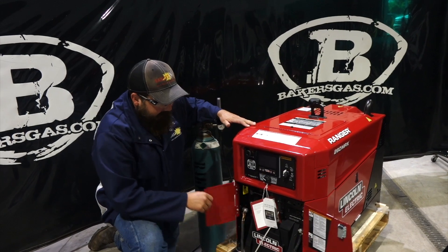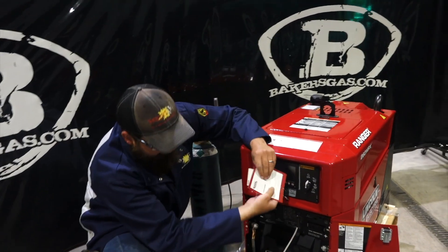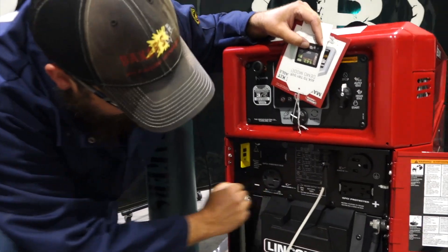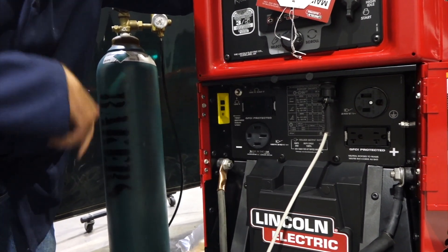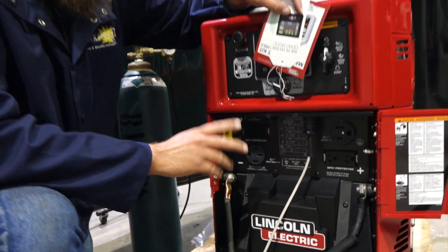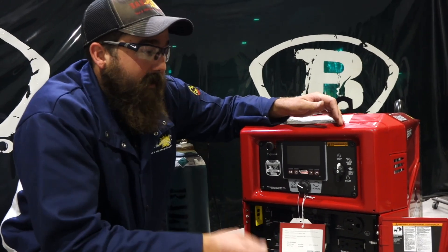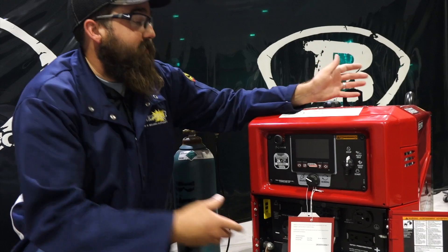You've got the two doors that open up, you've got all your tags — this is brand new. You've got your 110 and then your 220s, another 110, you've got your GFCI inline GFCI breaker, the battery's behind this cover — we've already hooked that all up. And we've got a spool gun with this unit that we're going to try out that is specifically made for the MPX series, the 330 and the 260.